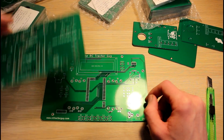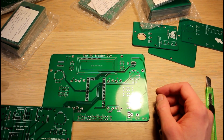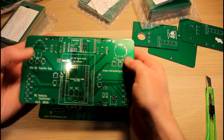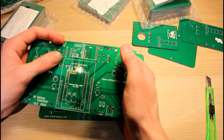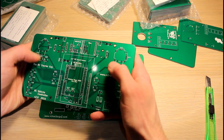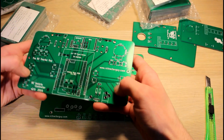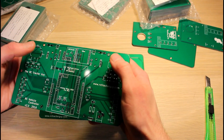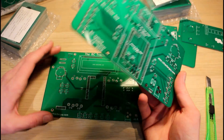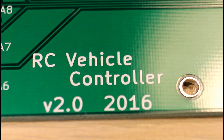This is the version one PCB and here's the new one — there was a lot of wasted space on the old one because I was just trying to get a working controller. On this second one, the space is used much better. We have two joysticks, two encoders one on each side, and three buttons. You have the buttons to control the LCD screen, and quick selects for the vehicles at the back so you don't accidentally push those.